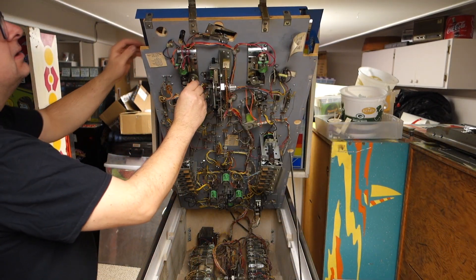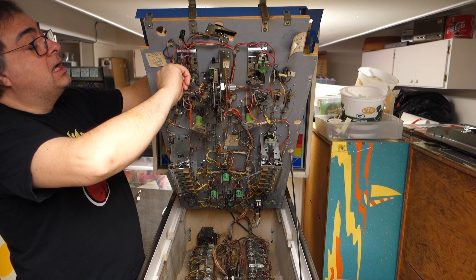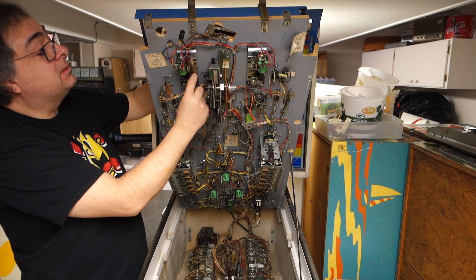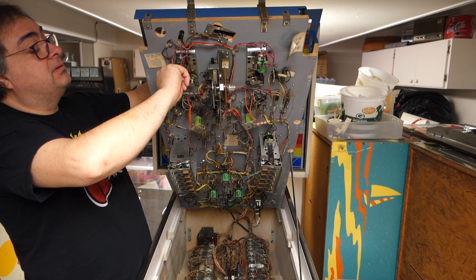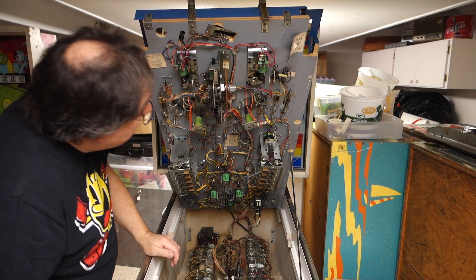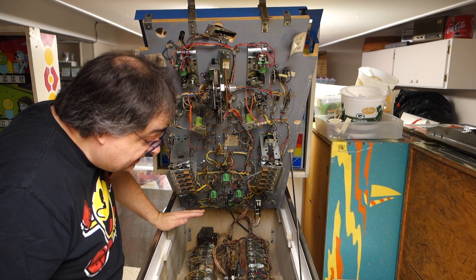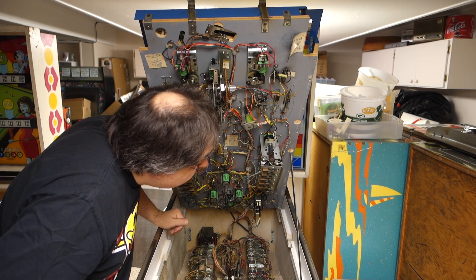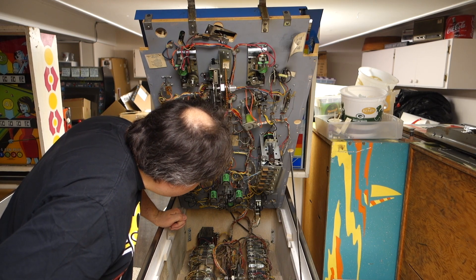They both have enough slop in this one. The bushing is missing most of its screws. All that aside, we still have some slop in the linkage, so that will get rebuilt. Otherwise, I didn't see too many issues under here. It's dusty, but it's basically clean — it's doing its thing. I don't see too many crispy coils, well I see two kind of crispy coils, but not too sure about them.